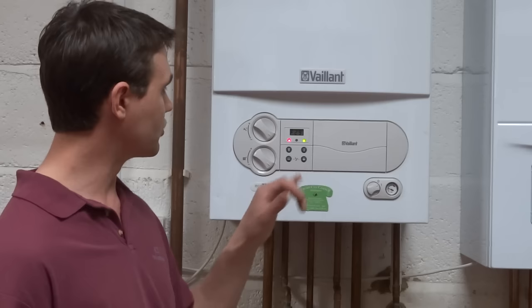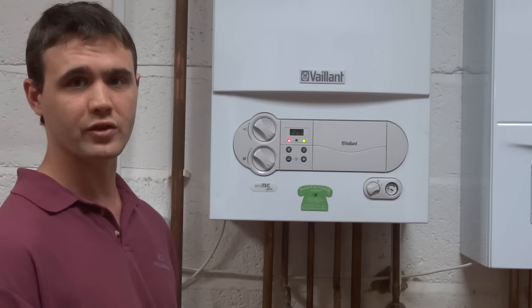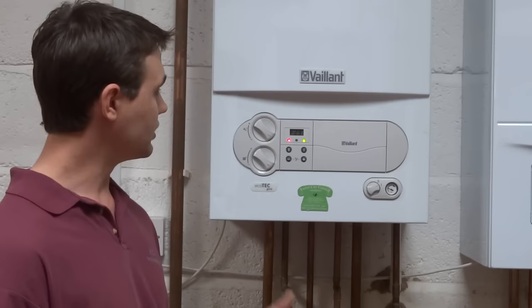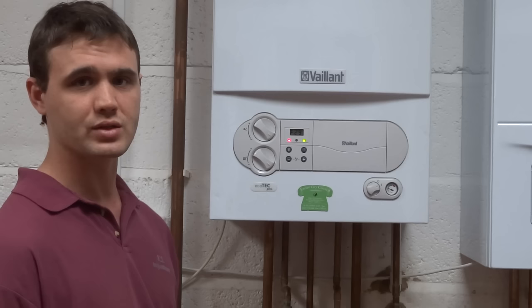The only other thing that could be wrong is that occasionally the new gas meters lock themselves off, in which case on the meter itself, in the bottom right hand corner, 'off' will be displayed in quite big black letters. You either need to hold the red A button in on your gas meter until you hear a click, and then the meter should say 'on'. Failing that, you'll need to ring your gas supplier or Transco and they'll send somebody out to repair the meter for you.